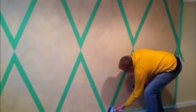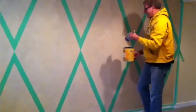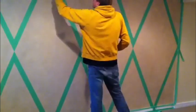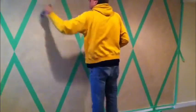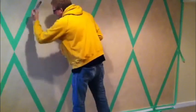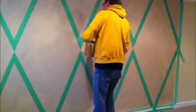Here we've got it taped off. I've got two passes of two-inch green masking tape, and then I'm putting on the Stays Clear from Benjamin Moore — a clear glaze. As you saw in my other video, this seals up the edge of the tape so any bleeding is done by the clear medium, giving you perfectly straight and sharp lines.